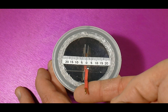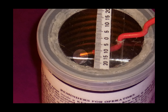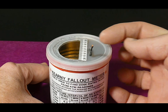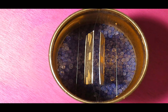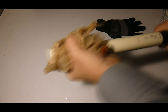If your meter's charge drains down too quickly, you have a leak. Several things can cause this: if the charging wire's lower end is too close to the leaves, it will drain the charge; getting your hand close to the exposed charging wire end will quickly drain the charge; not rotating the charging wire off to the side after charging will drain the charge; oil or dirt — especially from your hands — on the two stop threads or the fishing lines that hold up the leaves will drain the charge; and any moisture inside the can will cause the leaves to lose their charge.